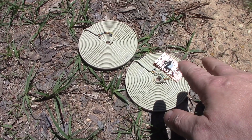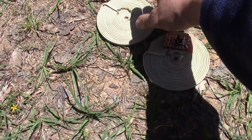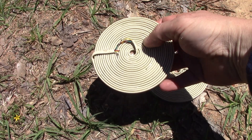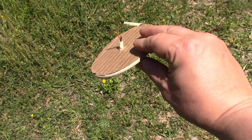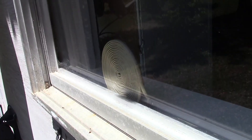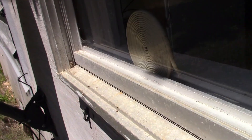I've just realised something while building the circuit — I've done this wrong. These connections should be on the other side, such that this one will be against the window on the left side, and the receiving coil will be pressed against it. What I really should do is poke these wires through to the other side. Fixed. It's not the prettiest because of the superglue, but now it will sit flatter against the window. What I was explaining is that I've put this one now behind there, such that when the driving coil goes in front it'll be the same direction and orientation — that normally works best. That's why I said it was the wrong way round, but it's fixed now.